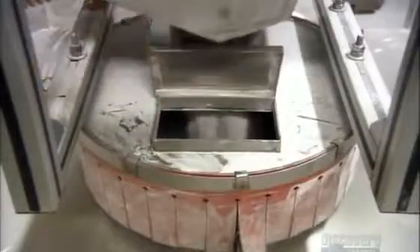To make spark plugs, they blend alumina ceramic powder and other ingredients with water. After a thorough mixing, the milky-looking brew drains into a big dryer, which converts it back to powder. The powder funnels into a mold, which closes to press the powder into the shape of spark plug insulators, and a binding ingredient in the mix helps them keep their shape.